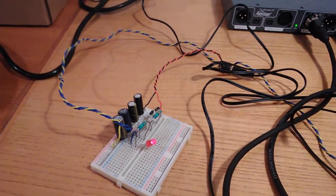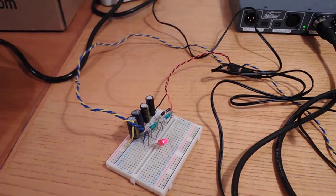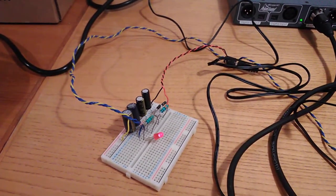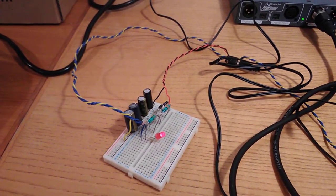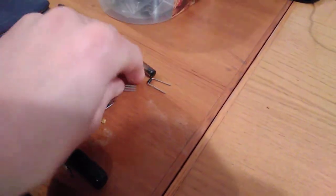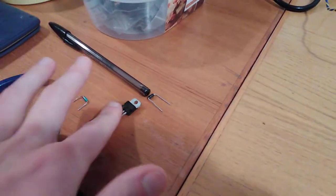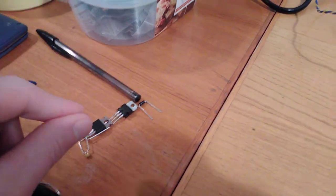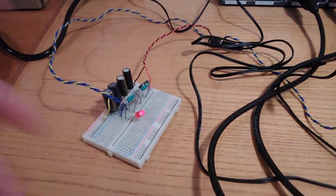And also, with an unregulated power supply, you've only got capacitors between the voltage rails and the ground. You haven't got any voltage regulator ICs like these, and these voltage regulator ICs consume about 10 milliamps current apiece, going from the regulator input down to ground. So they consume about maybe 200 milliwatts each just to idle. And with this power supply, you haven't got any of that.